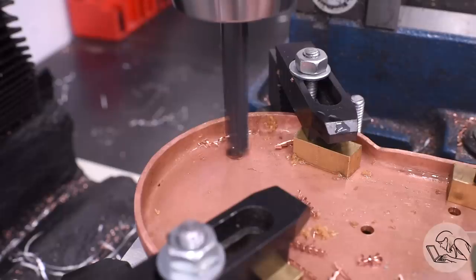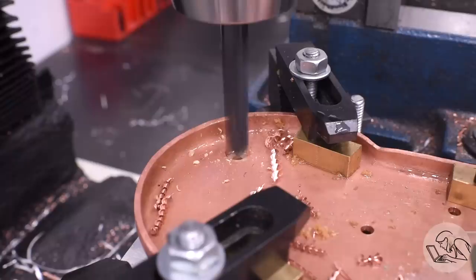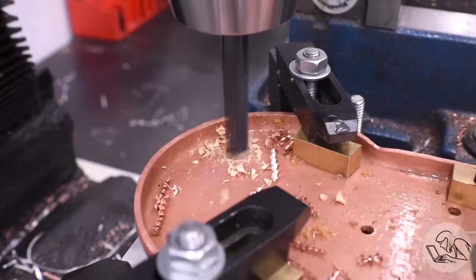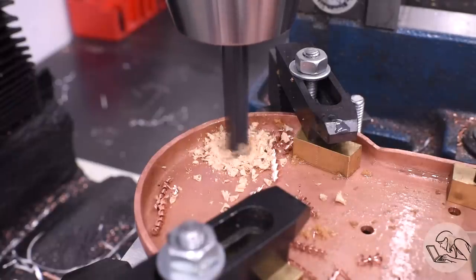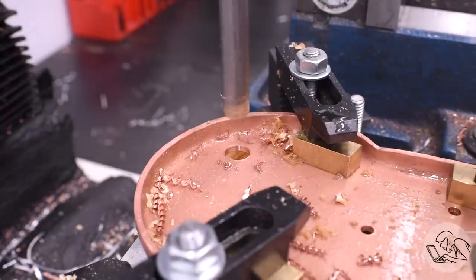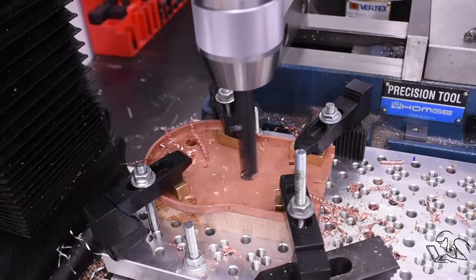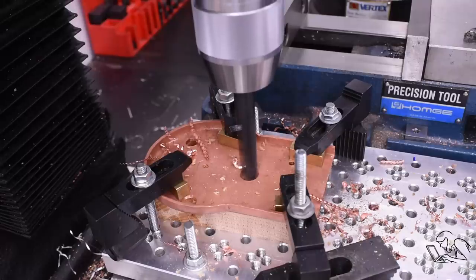They're going to get machined and fitted later anyway, but it doesn't hurt to do as good as we can here. And you'll note that I'm always drilling these holes extra deep into the wood underneath so that there's clearance for the reamer and/or the boring head as needed for each of these holes. The most exciting hole here is the fire door hole. That's where that fire door ring we just made goes. I drill this out as large as I can, which unfortunately is not very large. I don't have very big drills here.